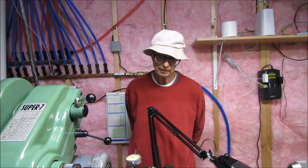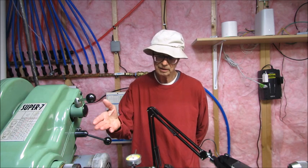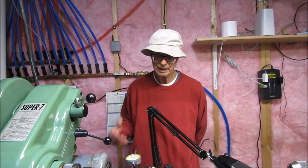One final word: I am no expert on this type of machining — I have learned by doing and reading. There is a great deal of literature on the use of ER collets and there are many different numbers for whatever purpose. I chose the ER25 because it had the most appropriate spindle for my particular lathe, which has a half-inch through spindle. Getting a larger ER collet would still handle half-inch stock, but I really don't have a need to hold much larger pieces than about three-quarters of an inch, which is why I bought the ER25.